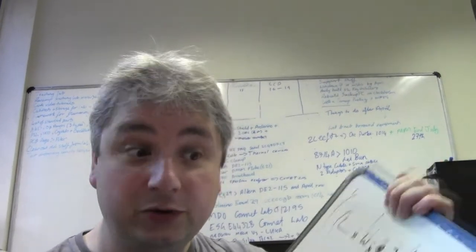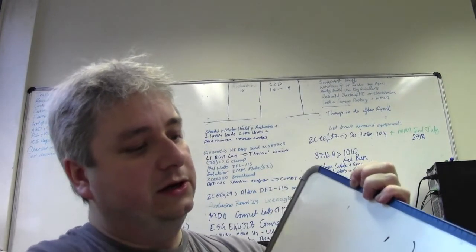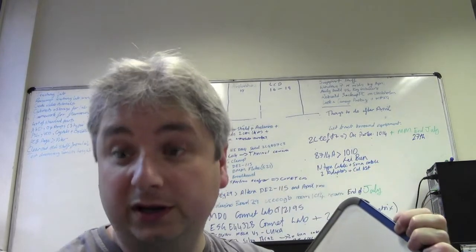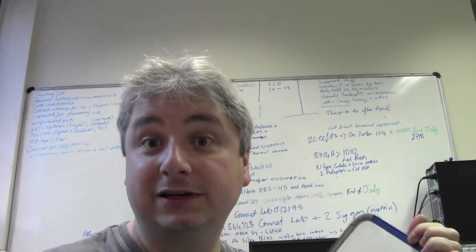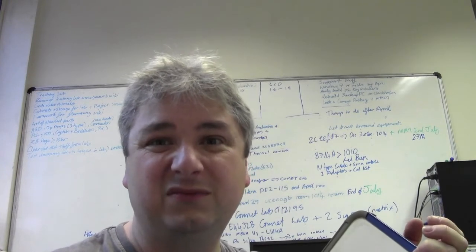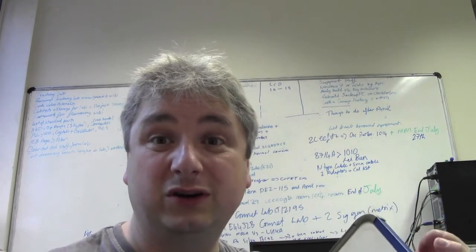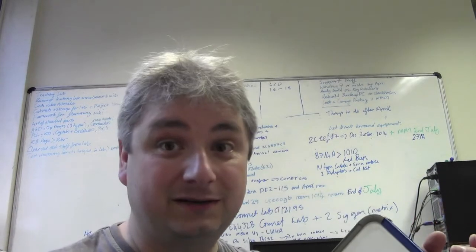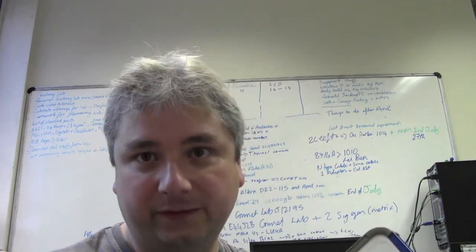Now, how long do you plate your board for? That's the next one. I'm doing mine for about half hour. You don't have to. This is the actual maximum plating time, but your board might plate a lot quicker, depending on what activator you use. If you've got an activator like what I've done, you will metallize in copper. So you actually run a nano layer of copper in your holes, so plating is a lot quicker because you've already got that copper layer there, so it plates a lot easier, unlike your inks and stuff like that. This formula was actually developed for inking, because that's what came first.